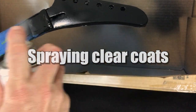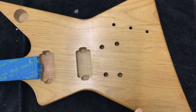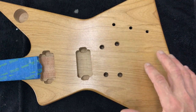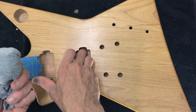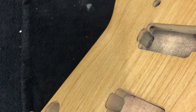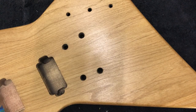I'll be doing three coats. The fine buffing oil product I've used on this EXP guitar kit is a combination of tung oil and wax, which means we can buff the finish — much like polishing your car. I've been buffing this for about 15 minutes now and you can start to see that slightly glossier front. I've done the top and not the sides so you can probably see the difference. That's basically how you buff out a wax finish — it's one of the easier finishes to apply, certainly a lot less messy and can be done relatively quickly. It may not offer the same protection as paint but it's a good option, especially if you're new to this whole process.